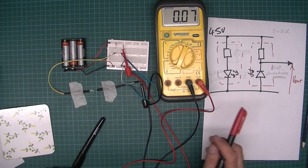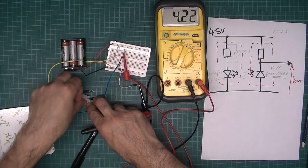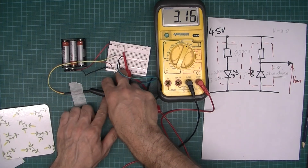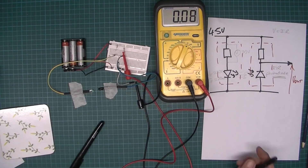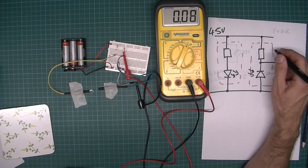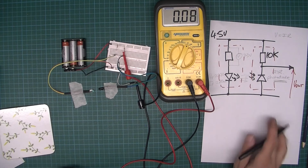If you're reflecting the light instead of interrupting it, there's no change in the circuit — the logic just changes a little bit. I'll leave you to think about that. For suitable values: for GCSE electronics you don't really need to do calculations on this — just use 10k for the resistor.